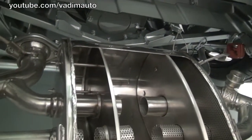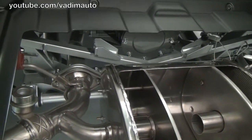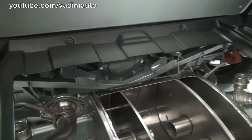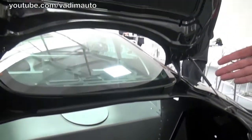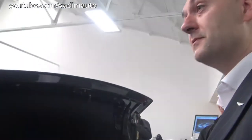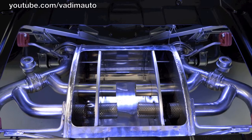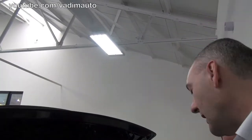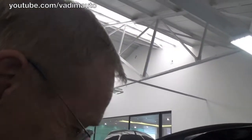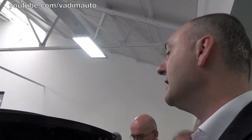The bit I'd like to draw your attention to, buried deep down underneath the trunk floor, is a new exhaust muffler. Not the most sexy thing in the world, but it is responsible for that wonderful noise that comes out the back of the car — also inspired by the One-77. If you look under the cars on the ramp over there, you'll see the geometry of the One-77; it's the same as this part. We developed it off the back of that. It's lighter by about nine kilos and gives a wonderful exhaust note, particularly in sport mode.